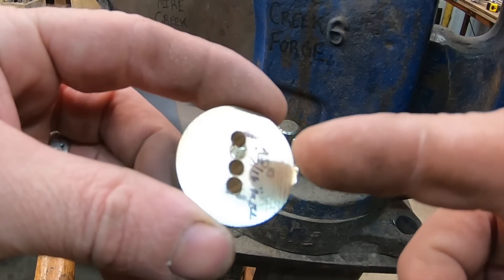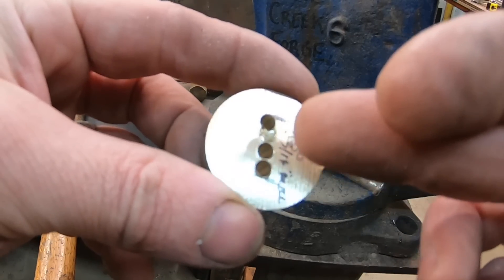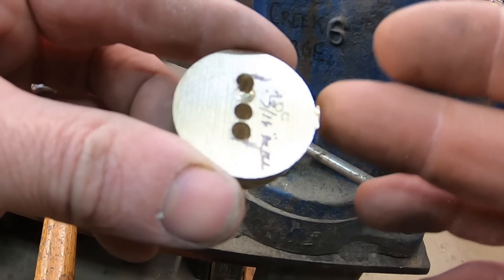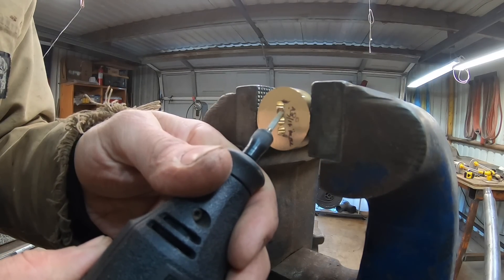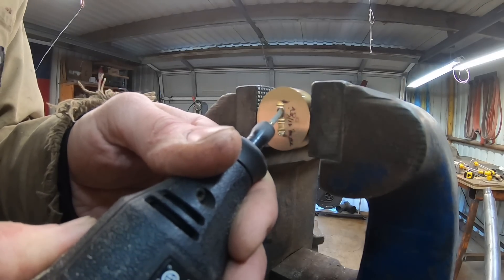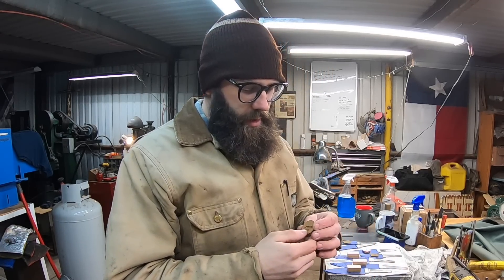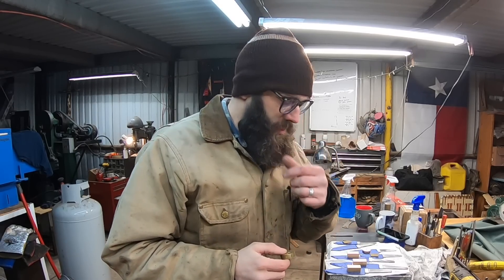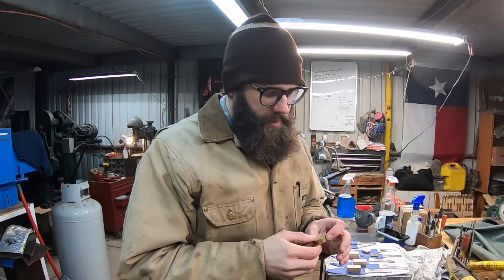I've got some holes in there — I might've been able to sneak in that fourth hole, but with the size of drill bit I'm using it's not going to work very well. It doesn't really matter because the next step is just hogging out material, being careful not to make this any wider than it is. That was the Dremel tool with a carbide burr — we're simply connecting the holes at this point. It's not great for precise or fine work because it can dig in, wander, and gouge. I just use it for hogging out material.